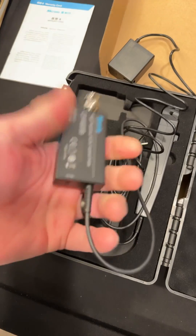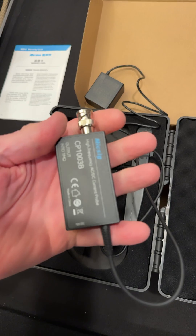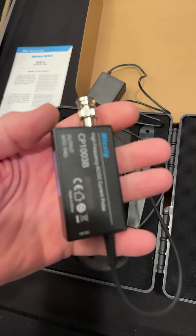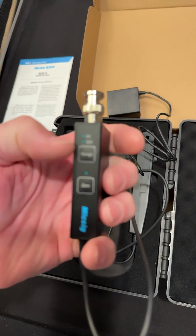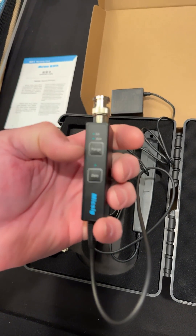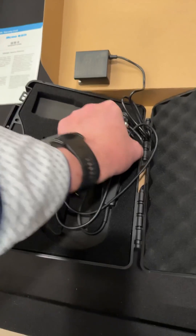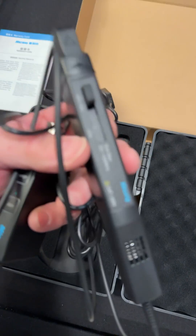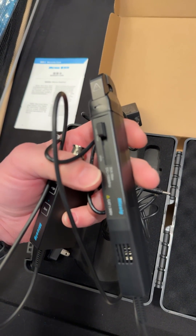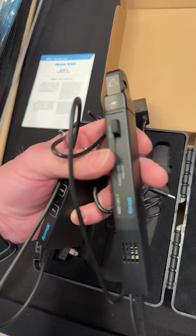And here is the magic — the little CP1003B AC-DC current probe, high frequency. It has a 5 and 30 amp setting range and a zero setting. These are super nice probes. It looks like the old Tektronix probes, right? 30 amps max, 100 megahertz — so that's the spec right there.